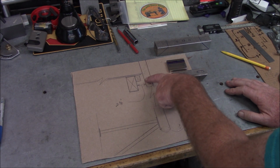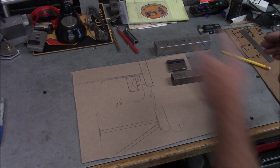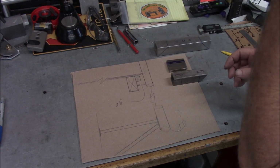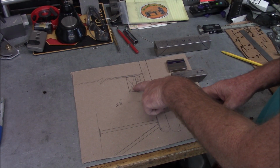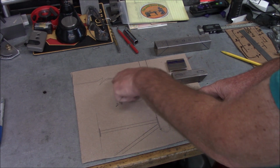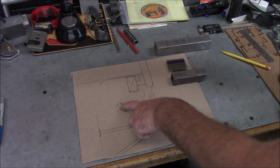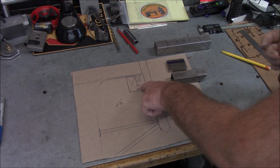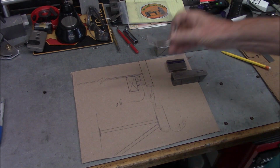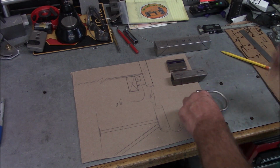So up here at the top, all we need to do is support the mast laterally, north, south, east, and west. We've got a rafter tail we're going to anchor to. But there's a trim piece, there's the roof sheeting, we got some shingles overhanging, so we got about a 2 1/4 inch overhang. So I need to make a bracket for the U-bolt that will work within that distance.